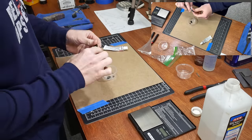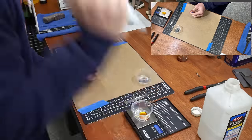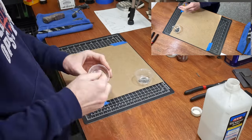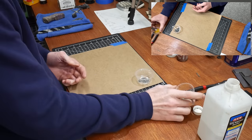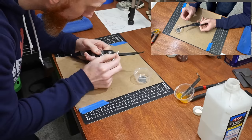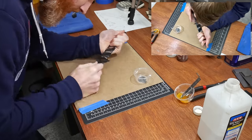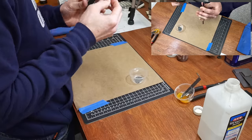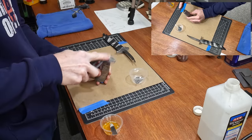The glue-up on this piece is a little complicated. I start off by mixing up a batch of JB Weld and one batch of G-Flex. The JB Weld will be used on the metal-to-metal surfaces and the G-Flex on the wood handle. I make sure to get some JB Weld around the front of the guard, just in case there are tiny voids from etching the wrought iron — I'd rather have them filled with a metal-colored JB Weld than left open.